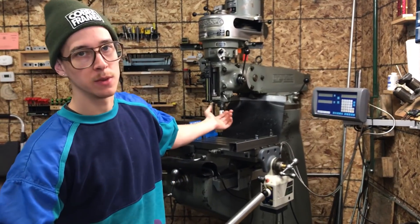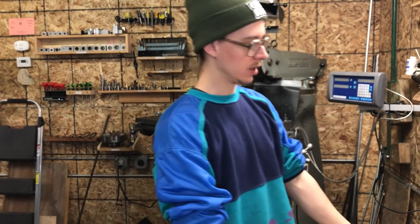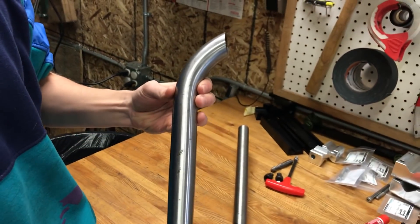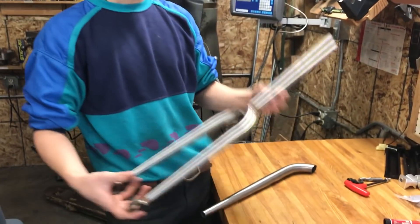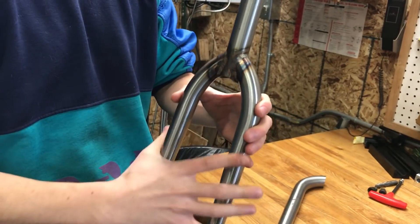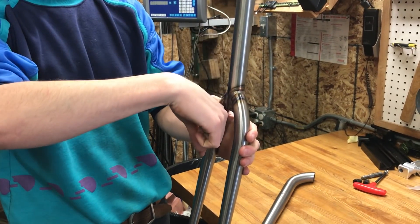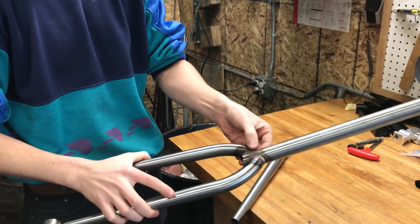One of the considerations is if you have a vertical milling machine and you don't have a horizontal milling machine, getting the tubes mitered to fit tight against each other is not particularly easy. The tubes come like this — cut at sort of an angle, sometimes more straight off. Your tube is going to come like this and you need to get it to fit tight against there so that you can weld it — the miter. If you look at the way these tubes intersect, you basically need to bring a hole saw in on the axis of where the steerer is going to end up being. You need a hole saw to come in between these, so you need some sort of fixture that holds both of these tubes — kind of pancakes them together — and allows a hole saw to come down between them and create that half-round shape on each, so you can slide in the tube and get a nice fit-up for the weld.